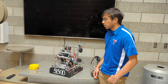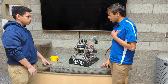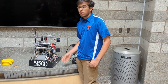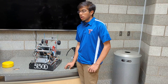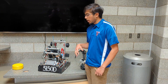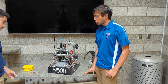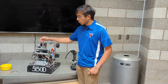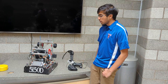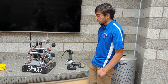If you saw us at worlds, before a match we'd just go and spin the flywheel. This really helped in the student semi-finals — we were waiting almost an hour before the last quarterfinals re-ran. Our robot was sitting there with values slightly drifting, especially for full-time shooting. We could just go next to our robot, spin the flywheel without changing placement, and that would reset all our gyros back to zero, ensuring no dumb issues.